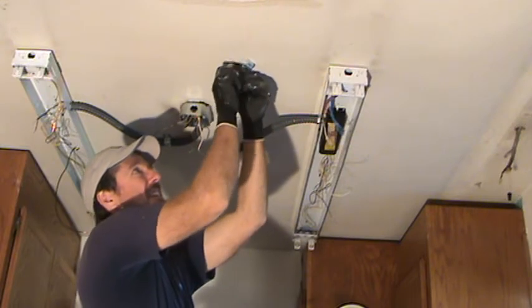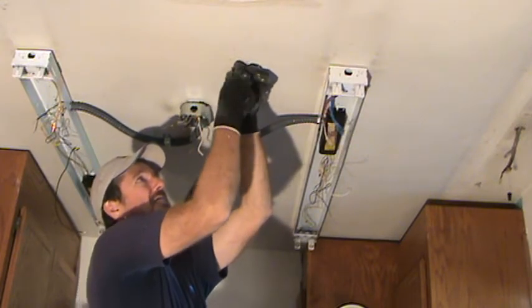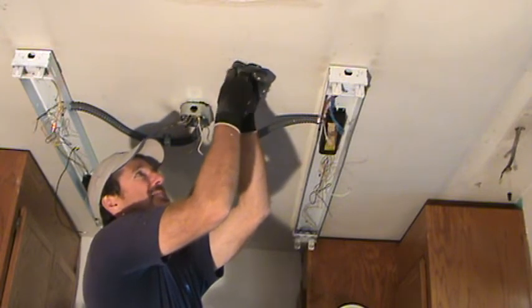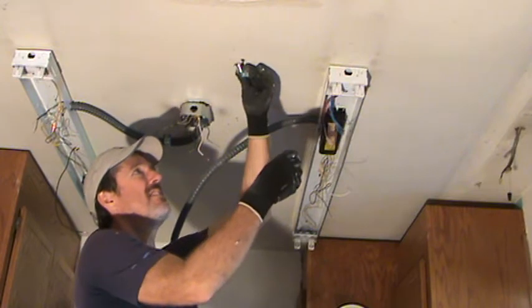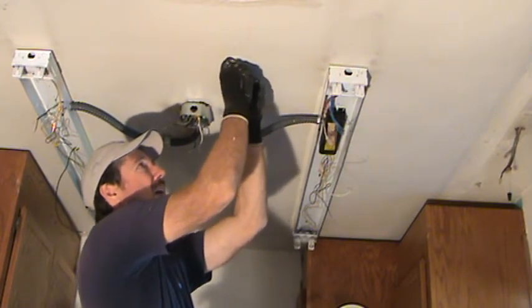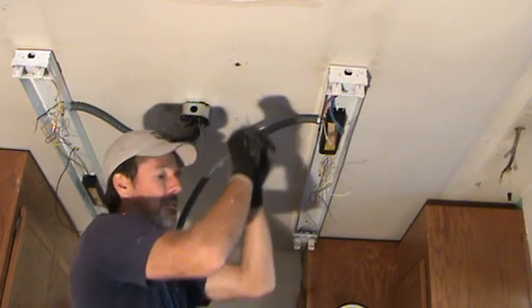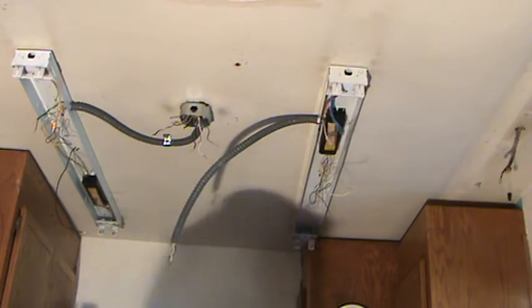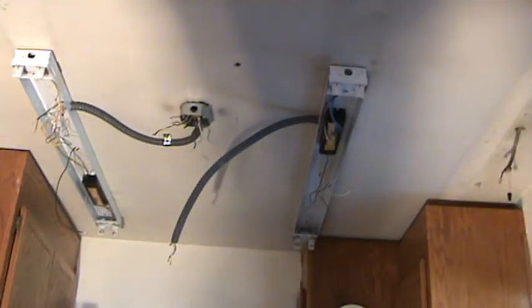The end is a spring-loaded deal that fits on both sides of the sheetrock. When you take it out, you just leave that other piece up in the ceiling. Oh, see how long that was? And push it up there, and then it spring loads, pops, and then you pull pressure, then tighten it up, and it zips back up. So that's how you take one of those off.